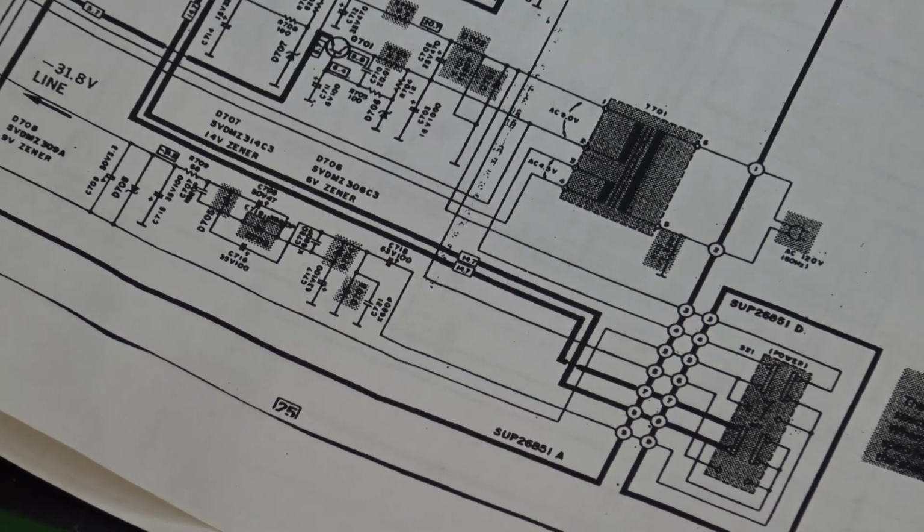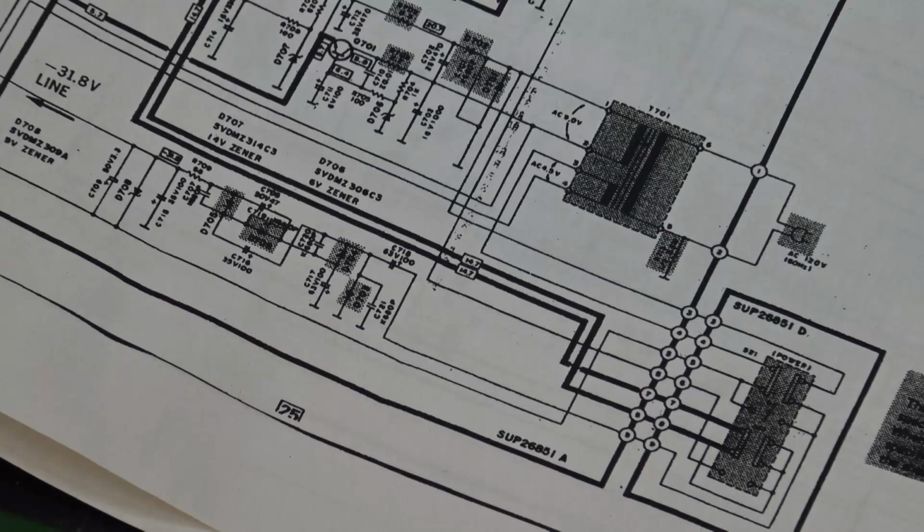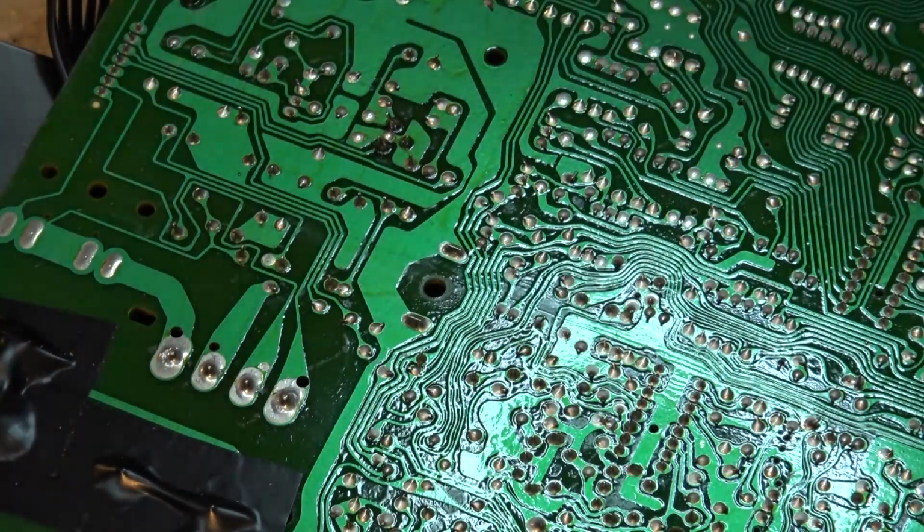Okay, my capacitors don't test bad for ESR, and I can't measure capacity in circuit with my other meter. I have to pull the capacitors out. So I started at C718, 716, whatever the one that we changed. That was the first part I pulled out because that's the first one. And as soon as I pulled that out, I put it on ohms, and oh, it's shorted. That would explain why it's not working. New cap, problem solved.